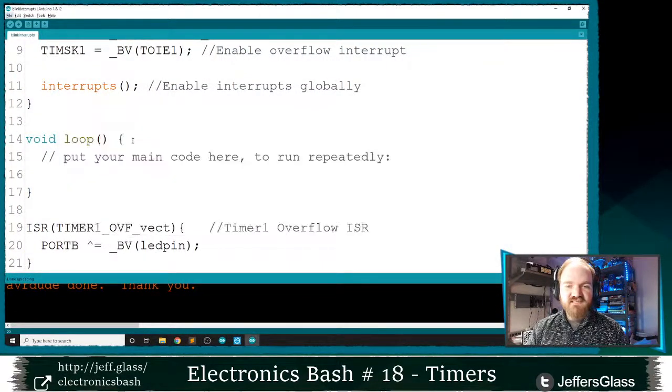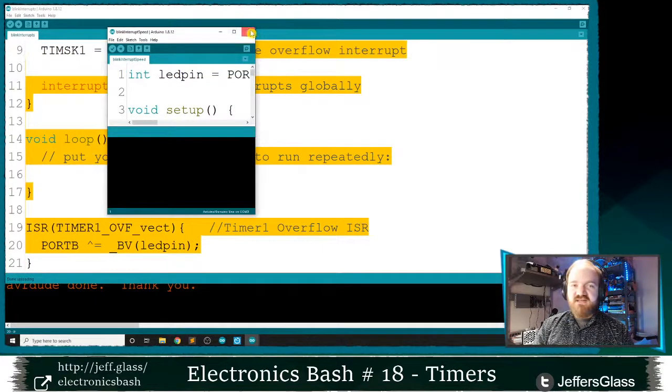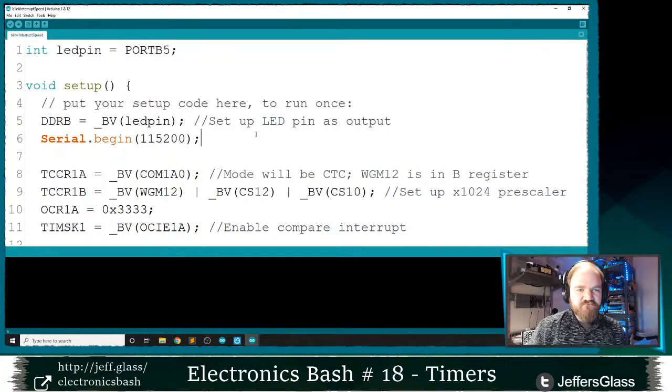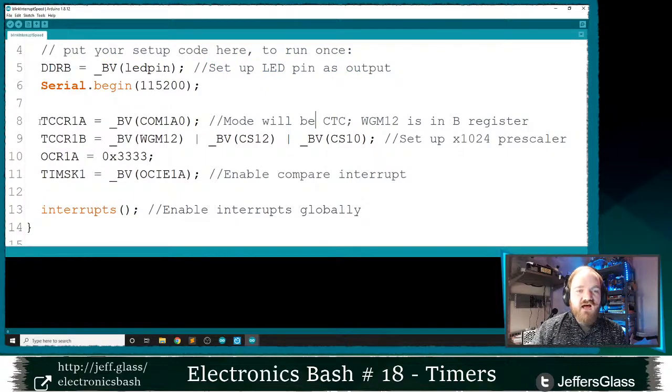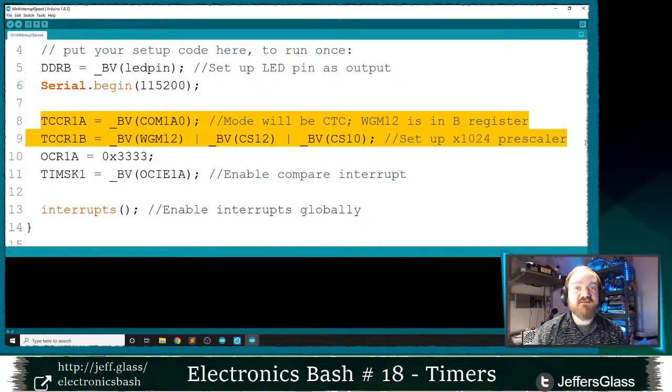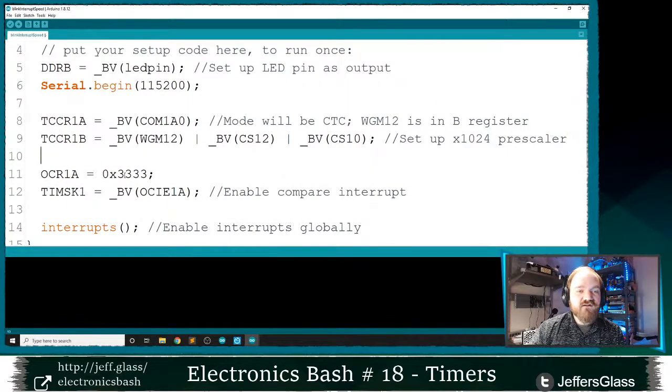But let me show you a slightly modified example using this CTC mode. This is the blink interrupt speed example, if you're playing along at home. So again, setting up the LED as an output, and I am using some control register to set up CTC mode, which I will explain in a second, but let me show you what happens so you have a sense of what it's doing, and then we'll show you the registers where you set this up. The thing to take away here is that I am setting the OCR1A, the OCR A register, to something small-ish, about a quarter of the size of the maximum value of this register. And then I'm going to enable...